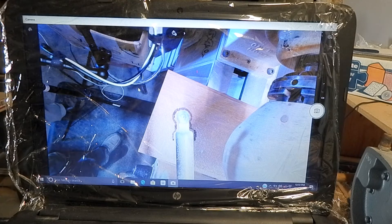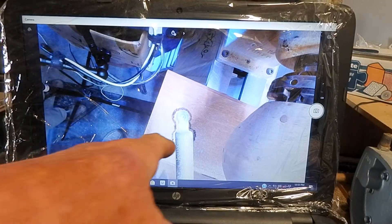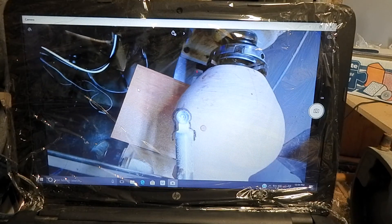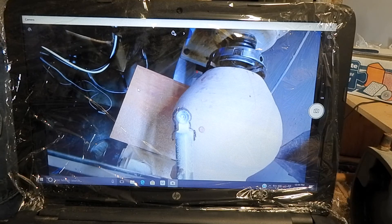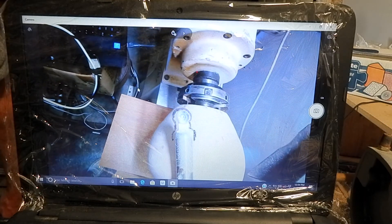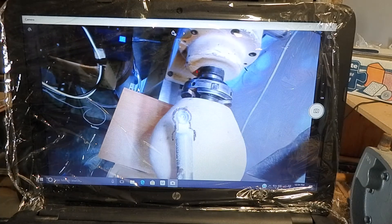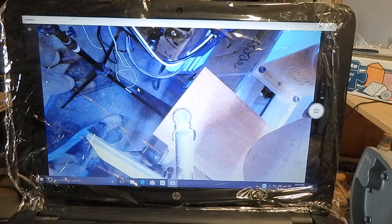Depending on the wall thickness you want is where you put the black line. I would use the outside edge of the Sharpie, not the inside. So on the outside edge — you can see there — when it's on the edge, that'll give you that much of a wall thickness. You can see how that cutter would follow on the inside, and it uses probably better than a third of the cutter. With a laser, you'd have to keep changing your laser to whichever part of the cutter you were planning on using.